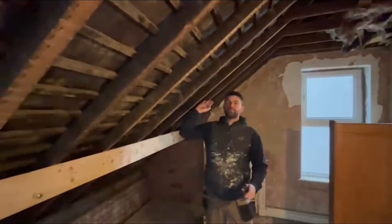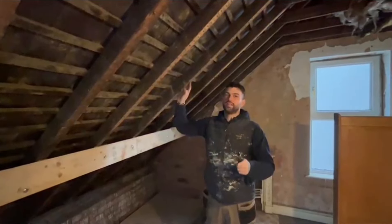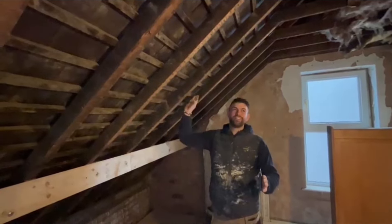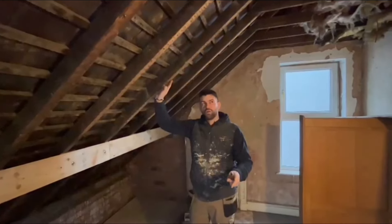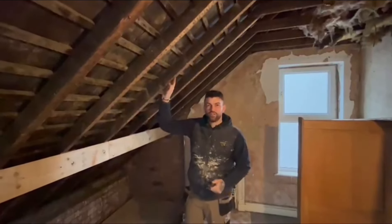The customer's asked us to come and board and give them a ceiling. There's no insulation in this ceiling and it's a very cold room - it's cold up here. So we're going to put some insulation in here. We've opted to go for 100mm of Celotex rigid insulation.